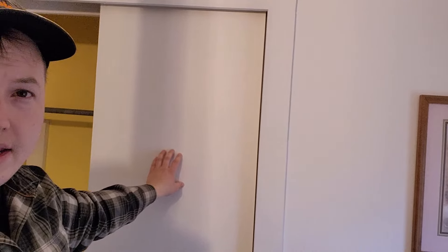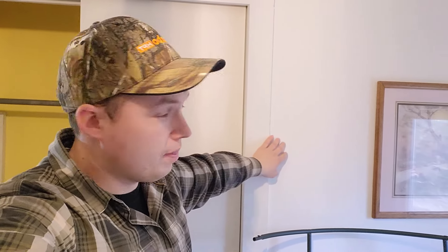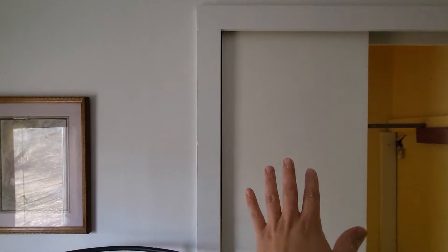Let me show you an example of it. Right here in this room, this door is the same color as this wall. I painted both with a latex-based white paint. I used the same latex-based paint, but this door came out much more yellow, even though I coated it three times — three coats of standard white paint. And you can still see some bleed-through in different spots because that wood has color to it, and it will soak right into a water-based product like latex paint.